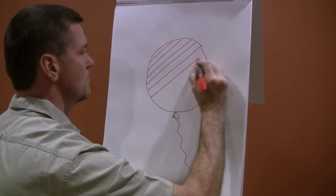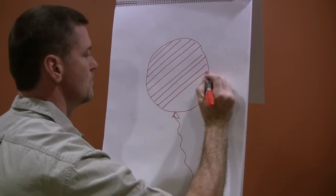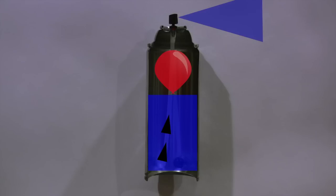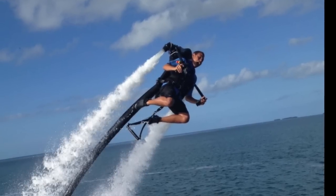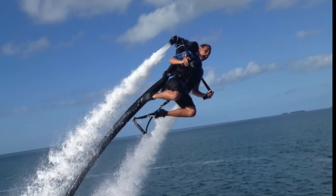That pressure is finite and will reduce as the product is used. Think of compressed gas as a balloon crammed inside that little tiny can. At first, when the balloon is compressed very small, it presses on the liquid inside and pushes it through the dip tube very hard and very fast. As the liquid is released, the headspace for the balloon becomes larger, and the pressure reduces as the balloon is allowed to become bigger. The other method is liquid propulsion.